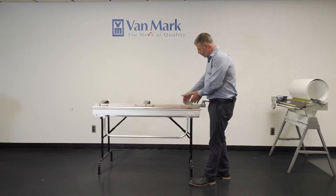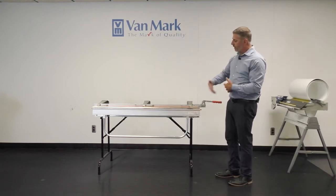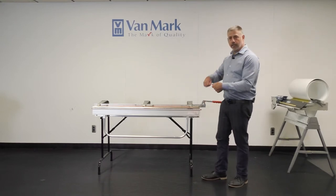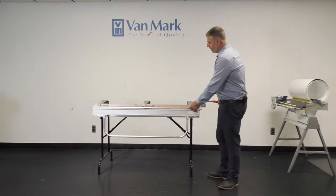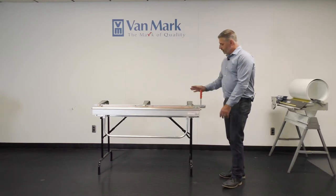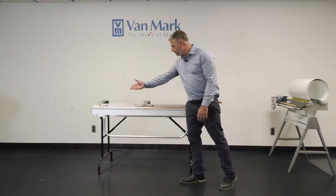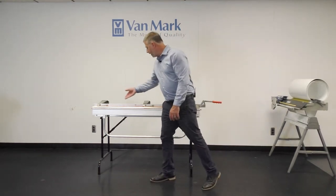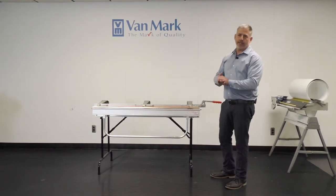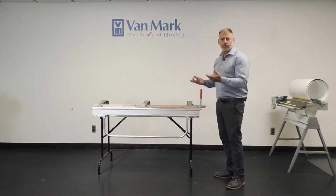The throat depth is shallow, so putting a 24-inch piece of trim on here makes it difficult. It doesn't have the rail system for a trim cutter, so you have to cut it with a razor blade, cut your material off, and then bend it back and forth and snap it off. This is a cam-style locking system done with metal wedges. You have to grease them — put oil on there. There's more maintenance to this; you want to do that roughly every 40 hours of work.